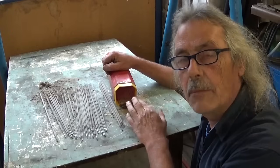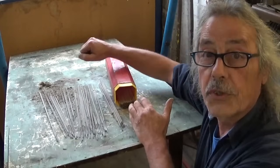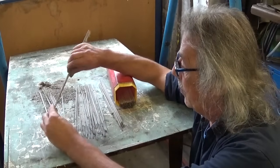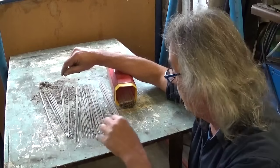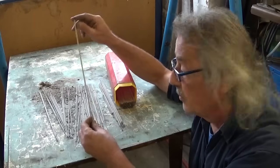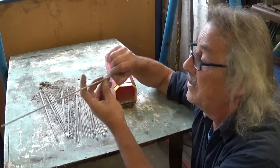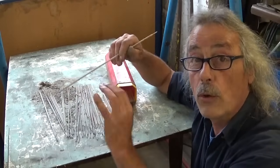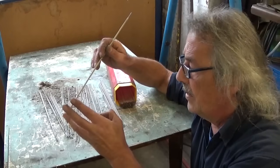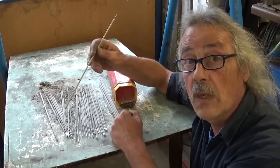To prevent it from moving while machining it's a good idea to weld these two points together. Some time ago I found at the tram depot a box with a whole mix of old welding rods. Some fall in pieces and are no good anymore, but the ones in the box are in perfect condition — these are 6013 rods, an all-round welding rod good in all directions. Because of humidity I don't want to make structural things with them, but for calipers, good enough.